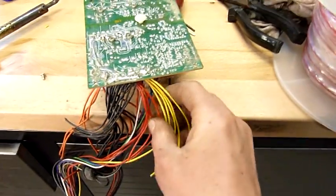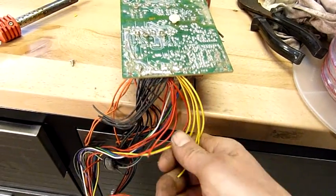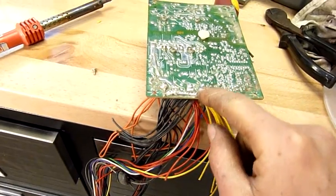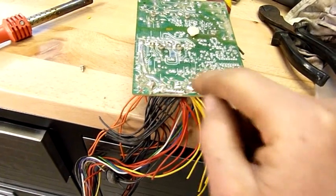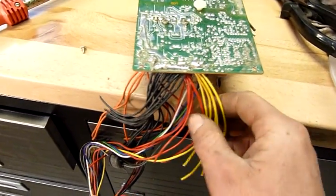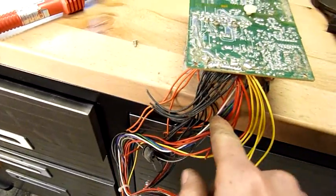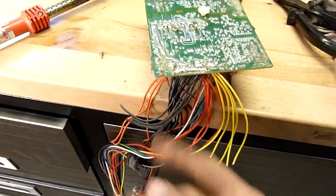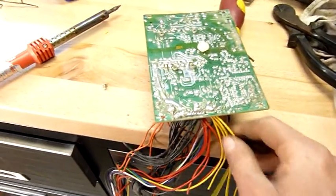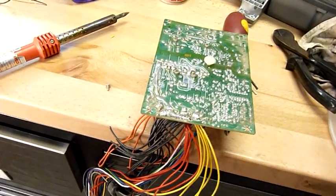It's the tidiest way to modify them, rather than try and cut and shut them all hanging out of the case — it's to actually take the board out and desolder them from the board, taking note of what goes where, and then rewire it after that. Of course, don't mess with the power-on signal, which is the green wire and a few other different wires in there. You don't have to play with them if you just put an in-line amp meter on it. Don't use a CT meter on DC stuff — it doesn't work.